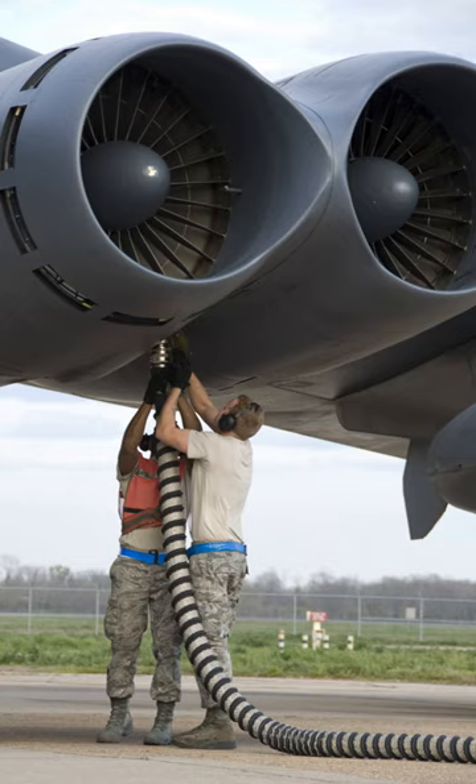Versions of the Rolls-Royce Avon turbojet engine used a geared turbine starter motor that burned isopropyl nitrate as the fuel. In military service this monofuel had the NATO designation of S-746 AVPIN. For starting, a measured amount of fuel was introduced to the starter combustion chamber then ignited electrically, the hot gases spinning the turbine at high revolutions with the exhaust exiting overboard.